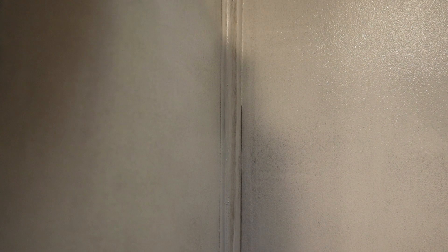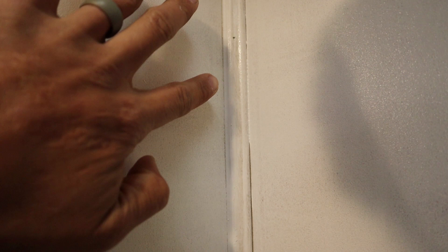I like to paint with the roller before I cut in, that way I'm covering as little as possible with the brush, because that's a very time-consuming process. But your last coat, you need to cut in first and then roll last, so that you don't have streaks. I intentionally did not caulk this side of the trim — only this side — so that you could see the difference. That side has lots of gaps and sometimes the paint will fill in the gap a little bit and you'll see lines, and then there's another gap. It just looks really crummy. That is why we silicone all the gaps.